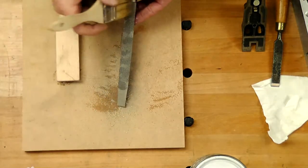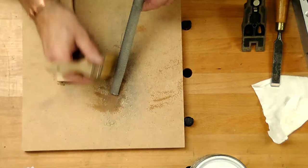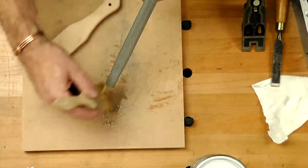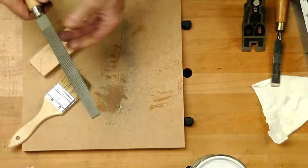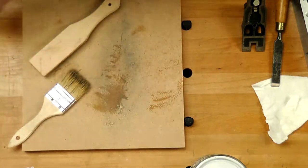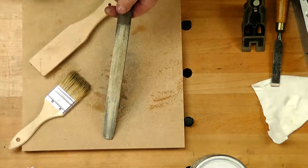We can do this, because this is going to be easier, believe it or not, than trying to do a wax. So that's the camellia oil. We brush it on all the way down through. That will sink into the metal particles, dry to a film. All right? One done. Really easy. Find a hand file.